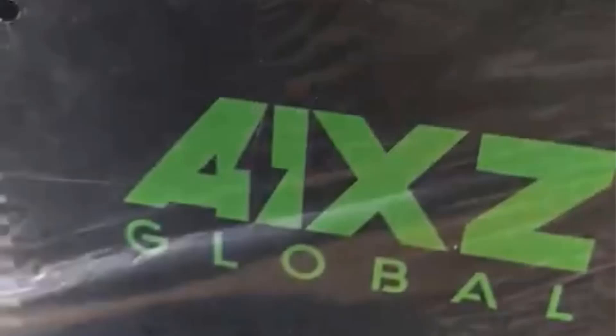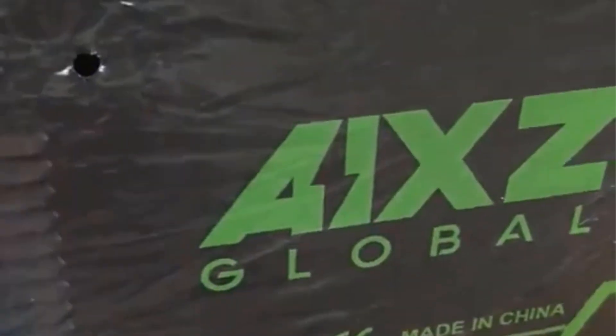The unit is designed for welding various materials including carbon steel, stainless steel, aluminum, and more, showcasing high efficiency at 85% with a 60% duty cycle. With IP21S protection and insulation class F, it promises durability and reliable performance in welding applications.